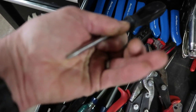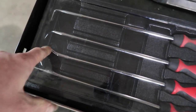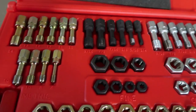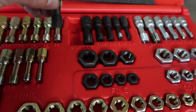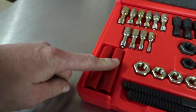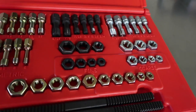Some Torx screwdrivers for whenever you get a weird Torx fastener. Down below there's large snap ring pliers and a very large set of hydraulic hose picks — that was a $20 deal on the Mac truck. Now this here is in my opinion one of the best values Snap-on has — this is a thread restore and thread chaser kit. It's not for tapping brand new holes, but for old fasteners that are gummed up or holes that need to be cleaned up. They fit on your wrenches, no tap handles needed. This entire set was $99 Canadian — a pretty hot deal. It also comes with thread files in metric and imperial, and for $99 I couldn't live without this.